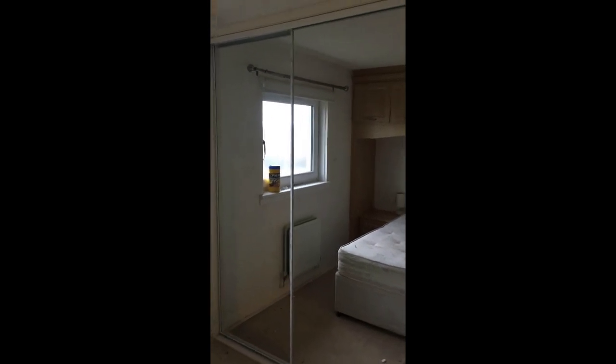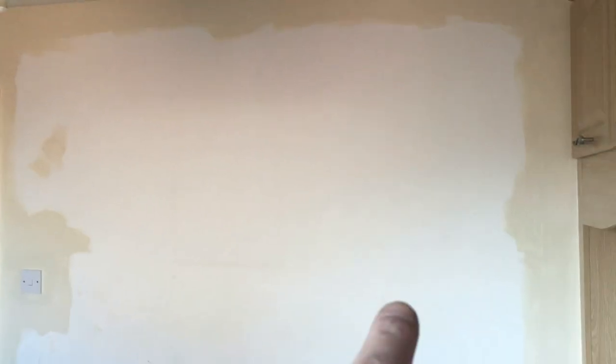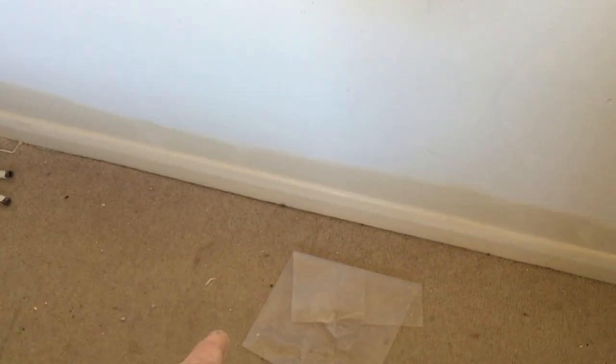That's another job off the list - I'm getting down to the painting now. This is bedroom two. The woodwork's not been done yet, so all the sealants in the house have now been done. Now I go into the walls and then the woodwork. This is going to be magnolia - cut in and do all the cutting in first on one wall at a time, making sure the paint's still wet and then rolling into the wet paint. I always use a sheepskin roller - I don't have dust sheets down as these carpets are effectively my dust sheets.